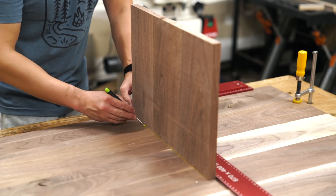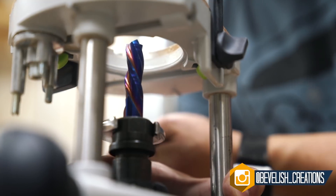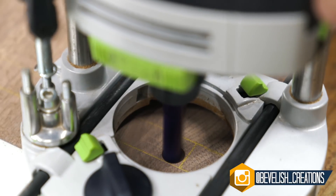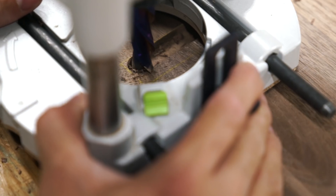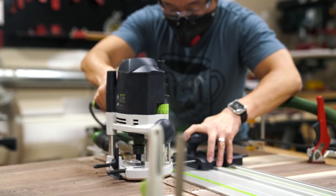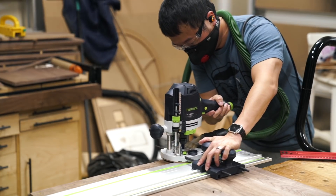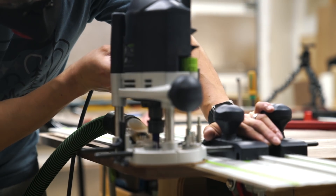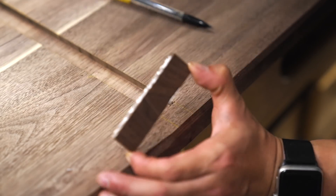If at any point you've got questions about this build, feel free to leave them in the comments below or DM me on Instagram at bevelish__creations — I'd be glad to help out. One thing to keep in mind with cutting these particular dados is that since the top panel is wider than the bottom panel, the cut in the top panel should end up further away from the front edge than the one cut on the bottom panel. And I totally forgot about this, so here I am making repairs.